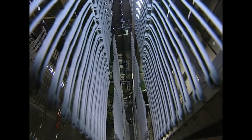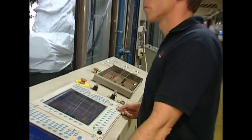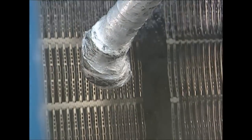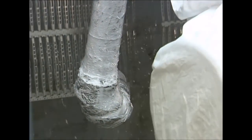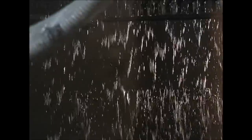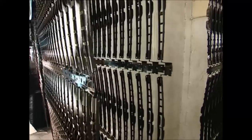Since wipers are exposed to all of the worst weather, they need excellent corrosion protection. A special device is used to paint the arms — the particles are electrostatically charged using 80,000 volts. A water curtain keeps the painting area isolated by filtering excess paint out of the air.